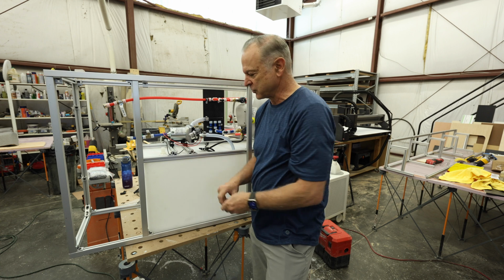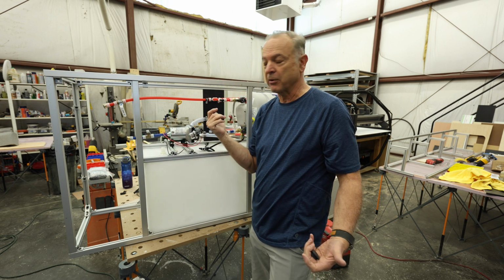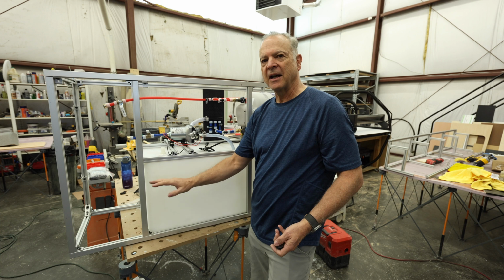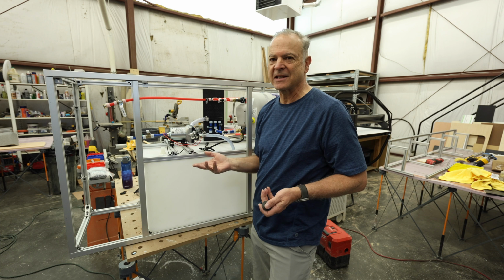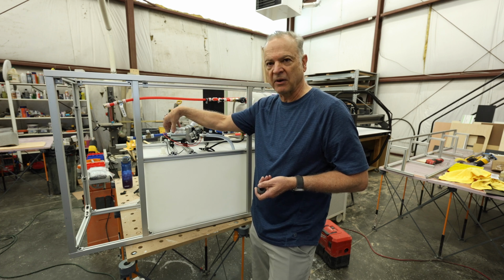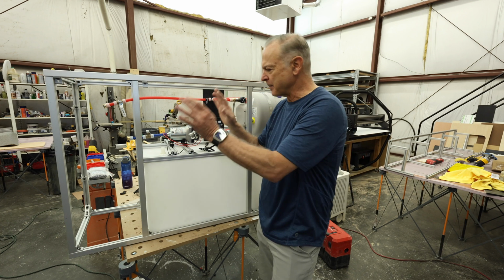And then we don't put a drain in the bottom of our water tank. In order to drain our water tanks, you just run your shower or your sink or both until the water runs out of it. That's how we do it. We just find that it avoids possible leakage by putting a drain fitting on the bottom. And so it's really easy. Just in a few minutes, you just pump the water out. These water pumps are made so that they can handle it running dry. They have a shut off if they overheat, and so it's safe to run them until they're dry, until you pump all the water out.